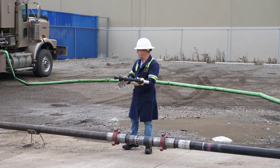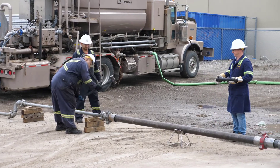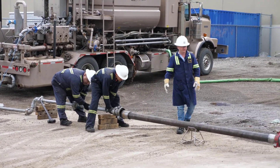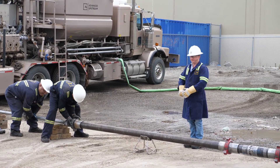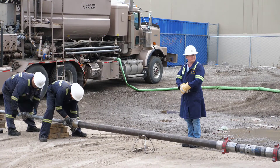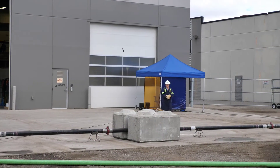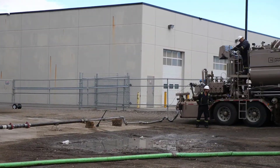So with that we'll get to it and get the guys to load it up. We'll open up our fixture and get going. Get the dart in there — it'll take a bit to push it in. In a moment we're going to fire the pump up and pump our dart and launch it through our fixture at about a thousand liters a minute.